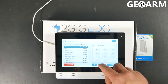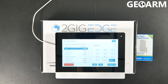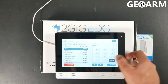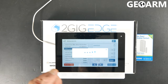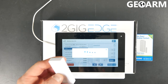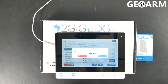Press the down arrow and it's going to move on to TX ID. It's a lot easier just to learn it in, so that way the system will recognize that it's responsive. You're going to hit Learn. If you still have the tab located in the bottom of the device, you would pull that tab and it would automatically learn it in. I've already done that, so in my case I'm just going to trigger the sensor — take the magnet, put it next to it, and trigger it a few times. And as you can see, it learns it in.